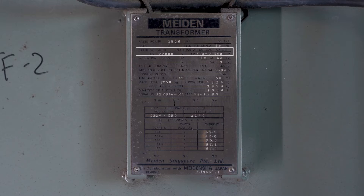We can see the rated voltages. On the high voltage side this is a 22,000 volt transformer. On the low voltage side we see the numbers 433Y / 250. This indicates a Y connection, and it says no load at normal tapping. When loads are attached to the secondary, the voltages would be reduced to about 400 volts and our nominal 230 volt line voltage.